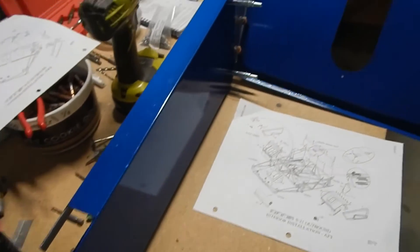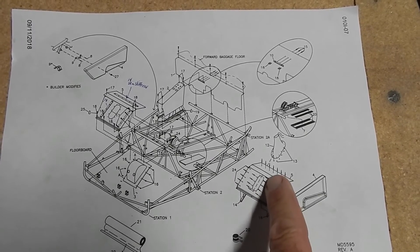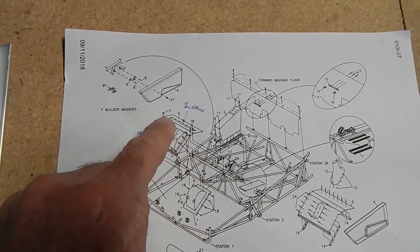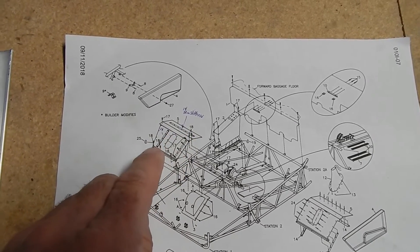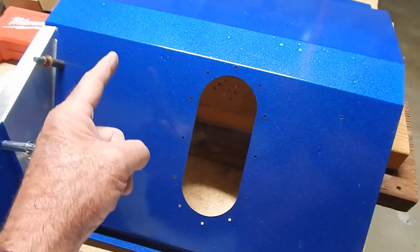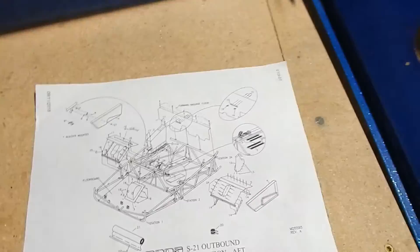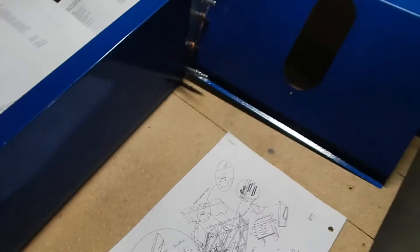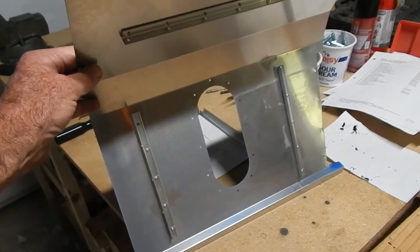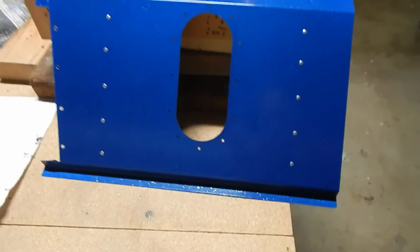With the piece out and holes drilled, I've got a stiffener that tucks underneath and what look like five-hole stiffeners along the edge, plus a stiffener on the flap. Looking at the diagram, there's a bar shown — I'm assuming that's stiffener number 14 — with one up top and one below. On my finishing piece I'll have one here, one here, and one back here. I've got the stringer supports in using 3/32 smaller rivets, with a line of rivets up top and one down each side.